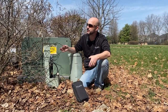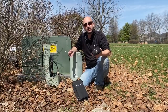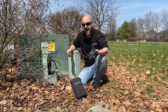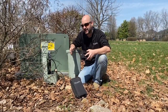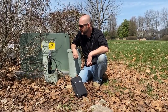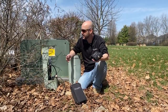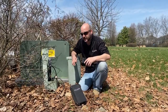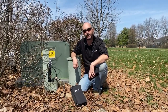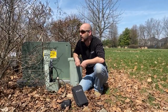This also allows us to optimize workflow. We're now very rapidly going in and touching the different touch points. We walked around a couple of places, went up into the attic, found the loose connector — the tool guided us to the area — then used the near-field probe to guide us to the exact loose connector. Same thing down in the kitchen where the customer was complaining of tiling and freezing. With that type of troubleshooting and guidance, this can allow anybody to be a shielding impairment expert. Anybody can pick this device up, listen for sounds, and see if there's a chew on the coax or a loose connector. It just makes life a lot easier to get in and out, optimize your workflow, and make your customer happy.